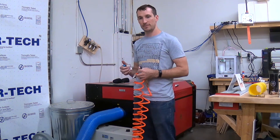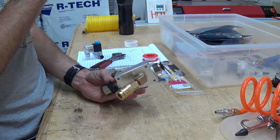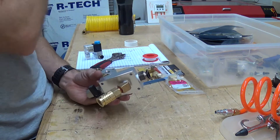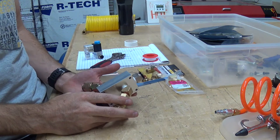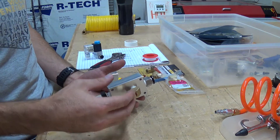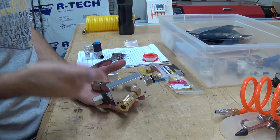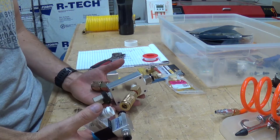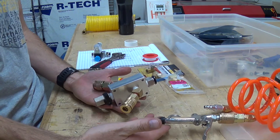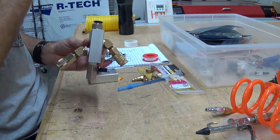Follow along as I modify our shop to be more efficient and effective. I'm going to start by pulling off that assembly that's on the wall currently, which has a 3/8-inch rapid air hose flexible tubing coming down from our compressor on the other side of the shop. This is going to be the new manifold — this side will come off with a flexible hose to that assembly that we'll move to the side of the laser cutter. That assembly has a regulator, a filter, and a dryer, and then after those we'll put on our 24-volt valve. Off this side we'll put our spray gun for dusting off and using air tools. This assembly will get mounted on the wall, and we'll move the existing manifold to the side of the laser cutter.